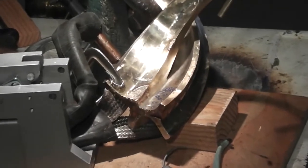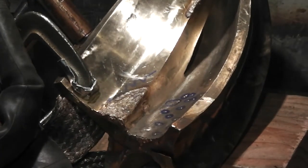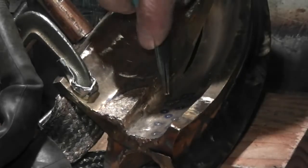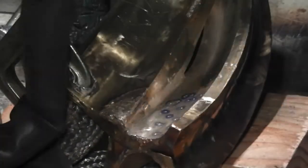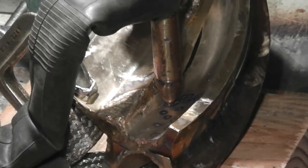This is a piece of silicon bronze sculpture set up to weld some small pits using one bottom cable a few inches from the weld area where there's a lot of material. The pits have been marked, cleaned, and peened. The area to the left of the small pits has been fill welded. This was done before the foot switch was added to the pit welder and before learning that flux is indispensable to getting a good clean weld.